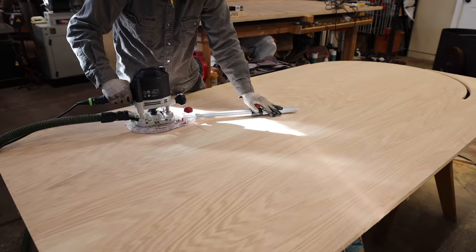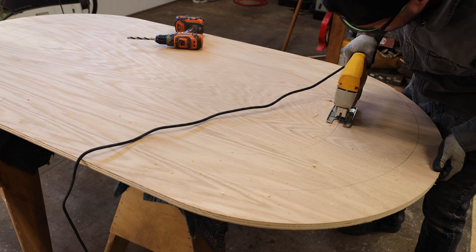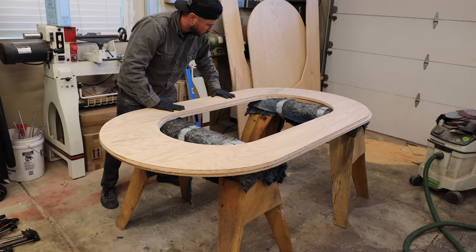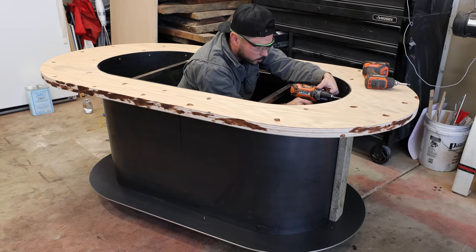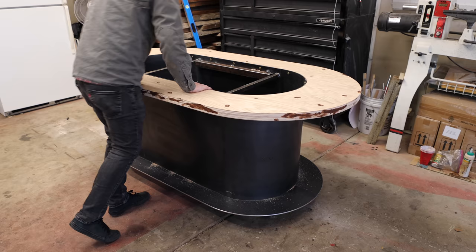The base is done, the logo is done, so now we're moving on to the wood structure. This top apron plate is what I'm going to use to attach flush with the top of the base, which will then attach to the top of the plank surface. You might be wondering why I'm using a jigsaw — it's because the top isn't quite perfectly true and I wanted to use the actual base for a scribe so I got it as close as possible. I did a stack of two, glued them together, and after about 24 hours I unclamped them and did my first test fit. Everything seemed to work out pretty good so I went ahead and did all my pre-drilling and mounting with some big GRK screws, about five inches long. I used my body weight to test the apron to see how structurally sound it was and honestly it was pretty dang stout — most of the movement you see is from the dollies it's sitting on.